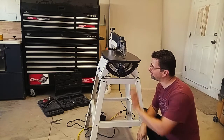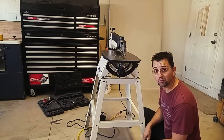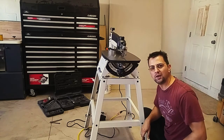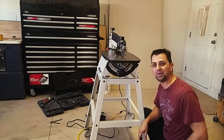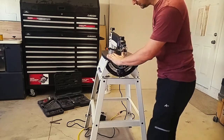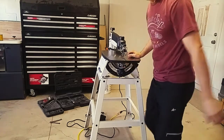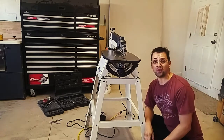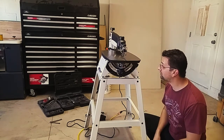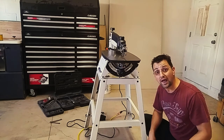The other thing I don't like is that all the moving parts underneath are completely exposed — they've made no attempt to hide or cover any of that. The moving parts where the blade connects are right underneath where that dial is, and there's no adjusting that bed while the blade is moving. If you do a lot of scroll work, you may get in the habit of reaching underneath to grab that knob — that's a no-no on this saw. Even standing up, it's conceivable you might reach a hand right where the mechanism is moving, and if you have a stool with your knee up, your knee could hit it as well. Keep your hands, legs, and loose clothing away from the moving mechanism at the bottom.